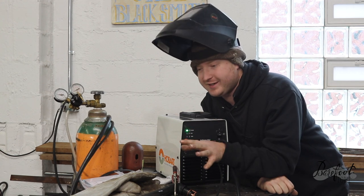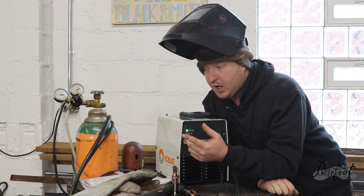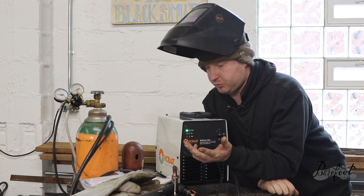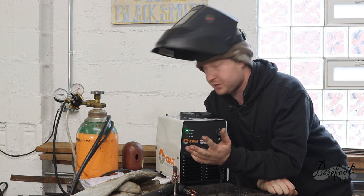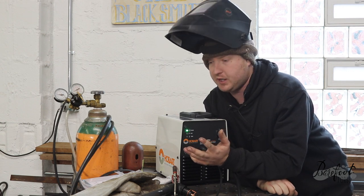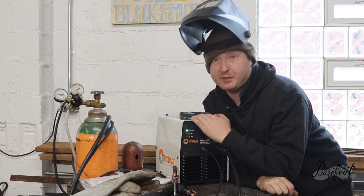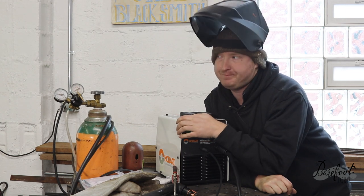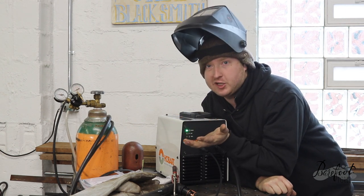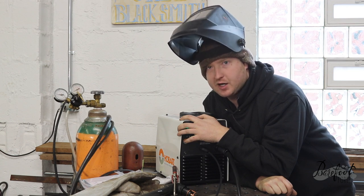First three cuts I made, I learned that the trigger switch, you gotta flip the thing up, and then it just is great. It is plenty powerful for 1/8 inch. I think we should try some thicker stuff, but man, it just flies right through it. Nice clean cut, no air compressor. This makes a little bit of noise, and then it does post flow for a little while, which is annoying if you're filming a video, but otherwise quite great. And just the idea that I didn't just spray angle grinder dust everywhere.